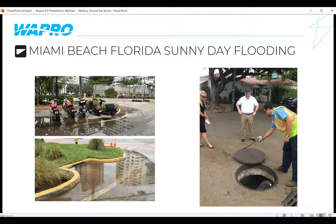To combat this during king tide events, what they were doing previously was installing black blow-up plugs into the outfall of the chamber to stop the water coming in. However, they would then have to remove these plugs to allow stormwater to exit during a rainfall event — a very resource-demanding approach. So they installed around 220 Wastop valves in various applications. Because they couldn't access the actual seawall, the Wastops were installed down inside the chambers on either the inlet or outlet depending on requirements — a very simple installation that completely stopped the sunny day flooding.